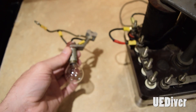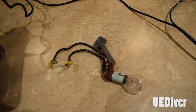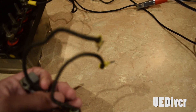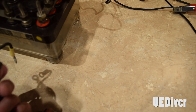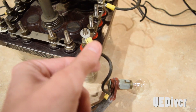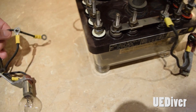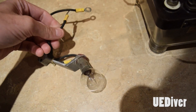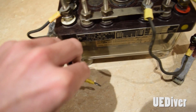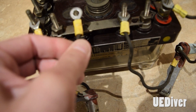What I have here are two railroad lights — these came off of actual railroad signals. I just pulled the actual light heads out. So I'm going to hook one light up to the positive lead right there, and this one's going to be one of the neutral tabs. Then I'm going to take my other light and hook this up to the hot terminal, and then the other wire to a neutral. Now these are all jumpered together, so I can put it here or here in the actual wiring.